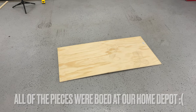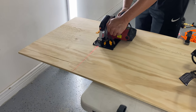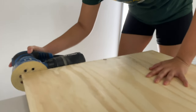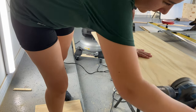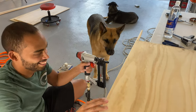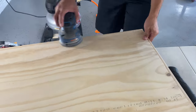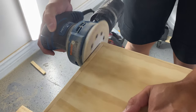The first piece we're going to start with is the bottom piece. It's a really bowed piece, so starting with it means the weight on it will help with the bowing. We're going to cut it down to 32 inches by 20 inches deep. Between each cut, I'm sanding down the edges so they're nice and smooth. Also, it would be a good idea to sand your wood before you finish the project, that way when you get to painting you don't have to worry about any finishing sanding. Next we're attaching the trim - the pine general purpose board - to all sides of this bottom piece, making the top piece flush so if you turned it upside down you'd have a hollow piece at the bottom.